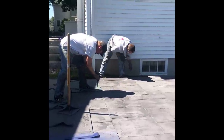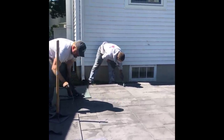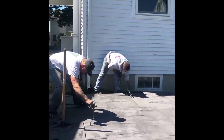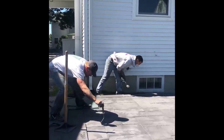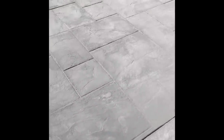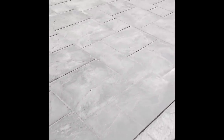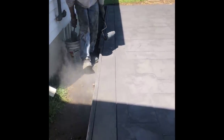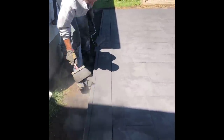What we're doing now is we're just touching up some of the grout lines. We use a little four-inch roller to do some of them, and then I'm using that little wheel over there — that works pretty good too. Sometimes when you pound the stamp into the concrete, the paste will kind of get squished up in between the seams of the stamp, so it's nice just to touch them up like that.